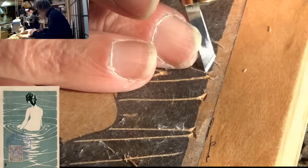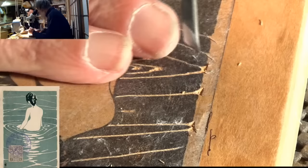Now, having said that, modern people working with stuff like Shina plywood and whatever, I've heard that they sometimes get a white glue, like the one we used here, put it in a cup, mix it with a little water, and brush this onto the wood as some kind of sealer. But I have no experience. I'm not recommending that. I'm just pointing out that some people do that. In our classical tradition with cherry wood, it's raw all the way down.